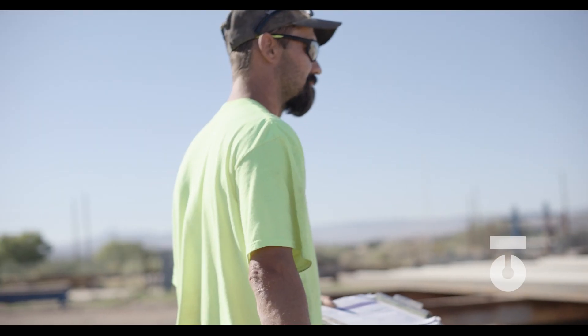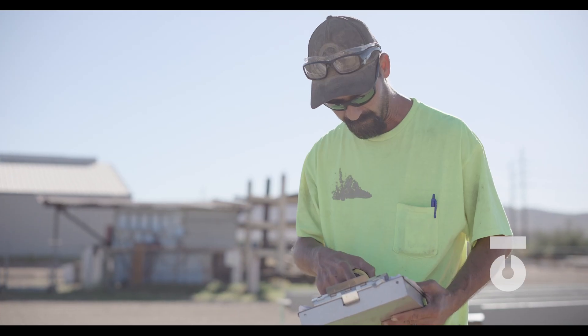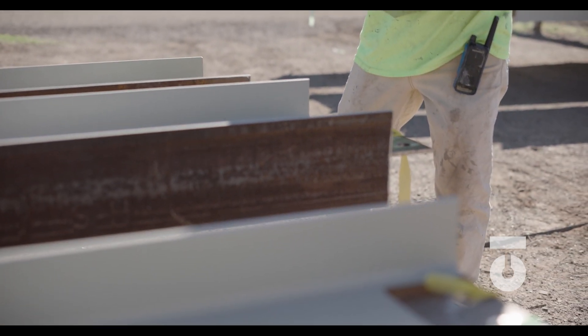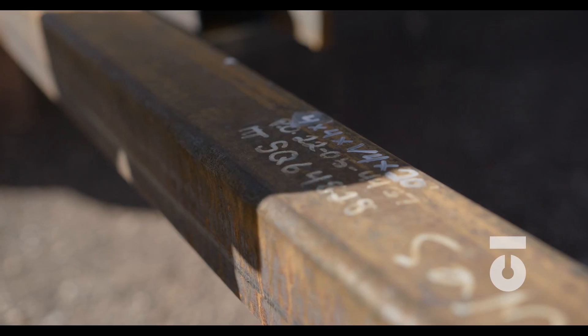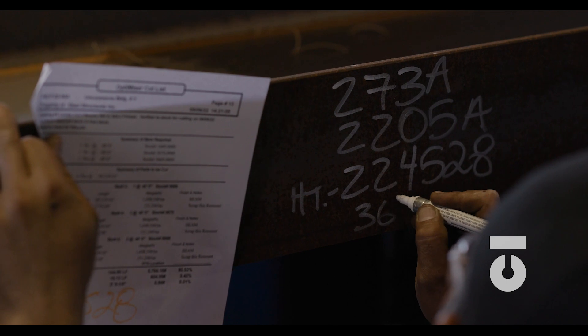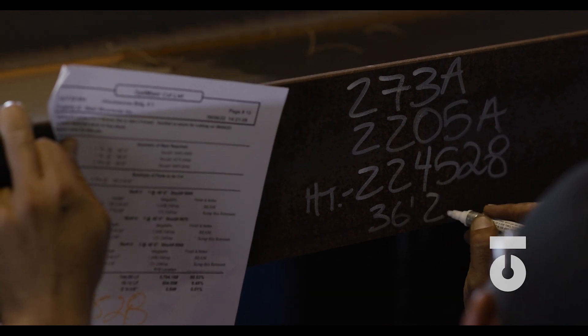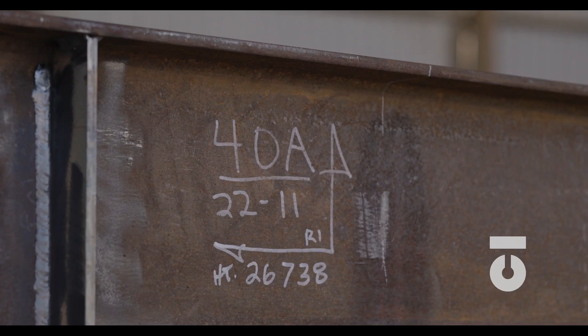Organization in a shop means traceability and staging — you have a means for tracking material and staging material in your shop so you know where to find what you need when you need it. When it comes to traceability, we utilize markings written into our steel by means of paint stick, stickers, and even barcodes if your shop has that capability. What is written on the steel at any given moment depends on what step in the fabrication process you are in. As we discuss the various steps, we will continue to discuss what you can expect to see on your steel.